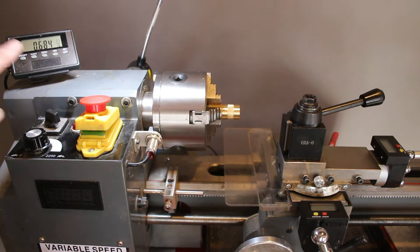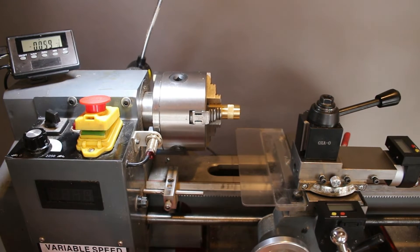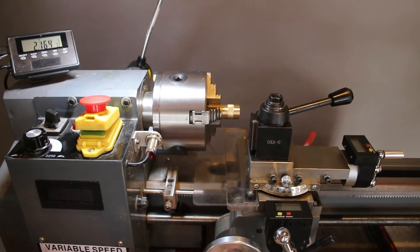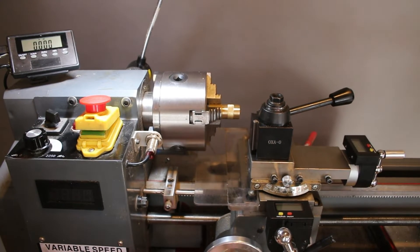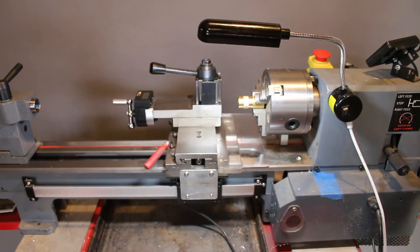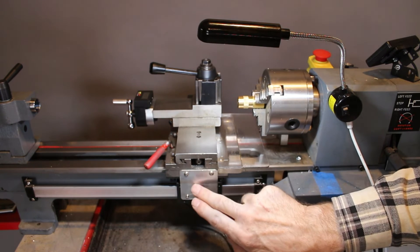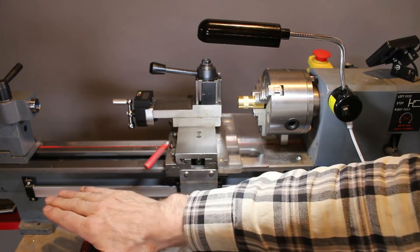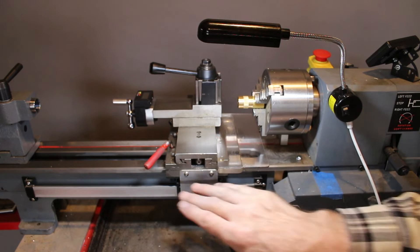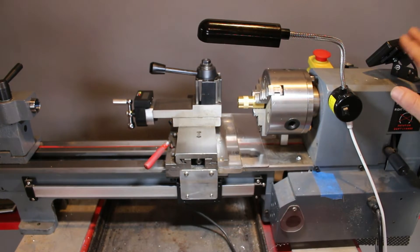Another add-on is this digital position readout, or DRO, which is for the carriage. As I move the carriage it gives you either absolute or relative positions — I can zero it at any point and go to relative positioning, or go back to absolute positioning so I know how far I am out from the beginning. Here's the back view of the machine — here's the linear scale and the sensor head. I simply used a piece of bent sheet metal to secure it to the carriage and to the sensor head. It's important to get this aligned perfectly so that it doesn't drift off and give you erroneous readings.